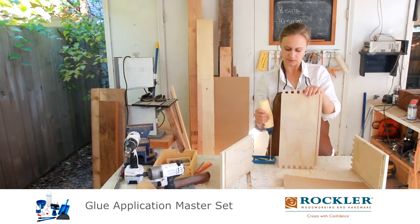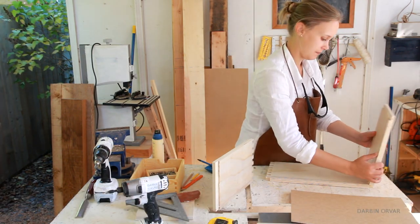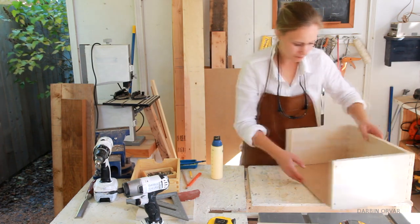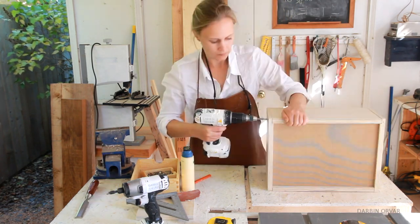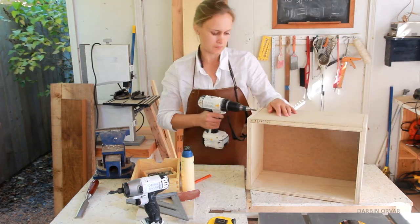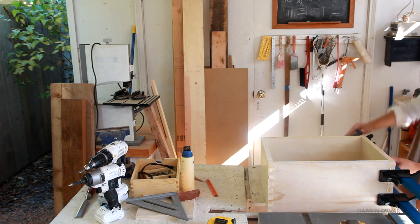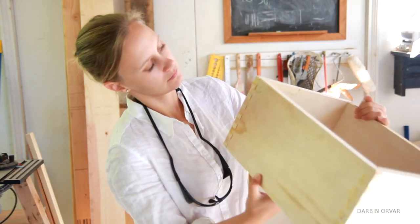Now we're ready for assembly. I simply glued in the box joints, making sure to get good glue contact everywhere to connect the pieces together. Then I slipped in the hardboard for the bottom in the groove, made sure everything is lining up right, and then put on the back. I drilled the backs in from the sides. To connect the box joints properly, I'm using clamps to get them to fit right — you just want everything to connect without any gaps. Then checking that it's square, and it looks good.